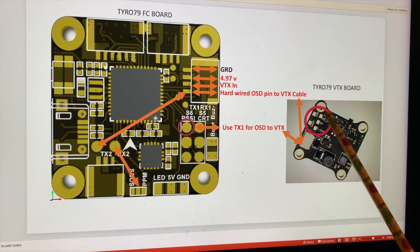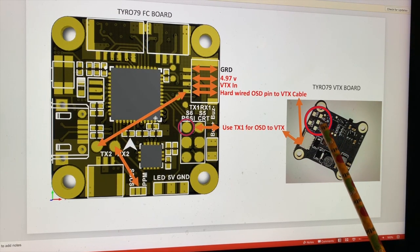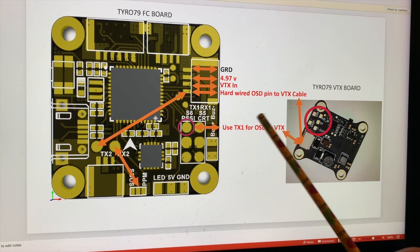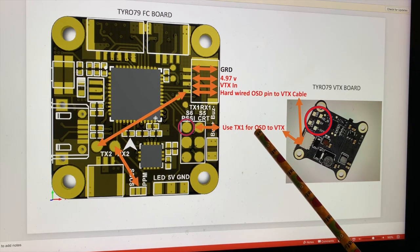I had to rewire from this cable harness because it's hardwired here — there's no doubt about that. If you notice, there's no pin here for OSD. They've got one for ground, one for video in, 5 volts out, 7 to 24 volts in, and something called CHDPDF — I have no idea what that is, I've been doing research, so if you guys know, comment below. What I had to do was cut the wire here and rewire it, and then I was able to go into Betaflight and select smart audio.